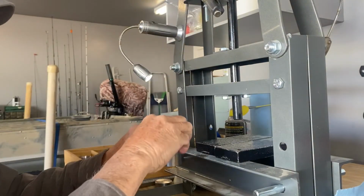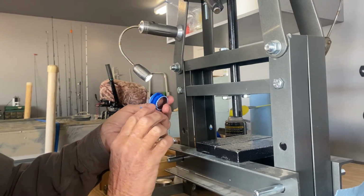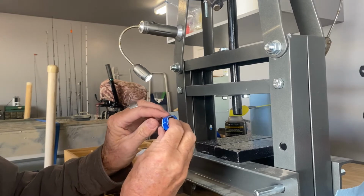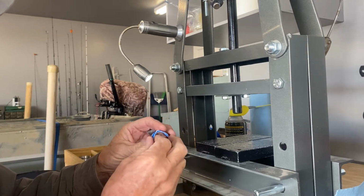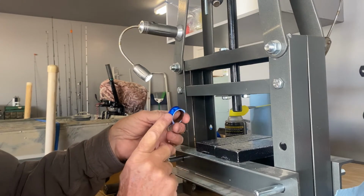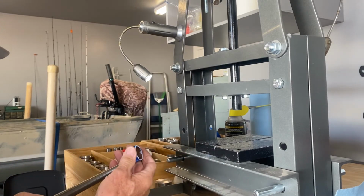Okay. Ooh, beautiful. Look at that. Oh, you like it. See the details coming through there. Look at that. See that bow is almost complete. When you get it to a point where all the detail is perfect there, you can see the detail perfect. It's still coming through. That lets you know that the bow is out. See, that bow is all gone now. There's not going to be a bow in this ring. Look how nice that is. No bow.